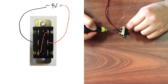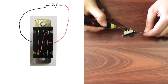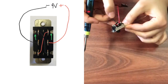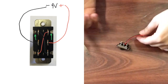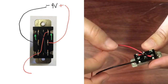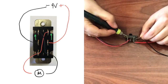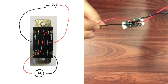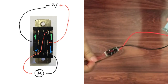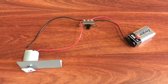The positive end of the 9 volt battery connects to that middle pin, which is basically our off switch — nothing is connected and nothing goes through. When we flick the switch one way, the motor will go in one direction. If we connect the red wire of the motor to one side and the black wire to the other side, flicking the switch the other way makes the motor go in the opposite direction. In the end product you can see the battery, the switch, and the connections to the motor.